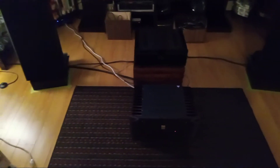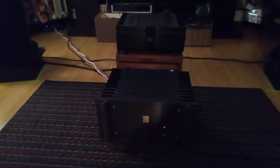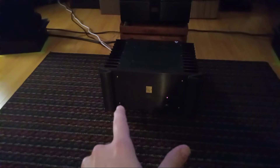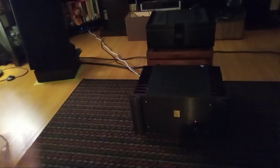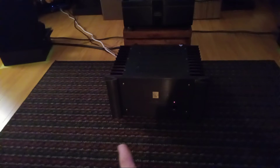Basically, it's ground noise. Specifically, I have a customer's Threshold T200 power amp in, and this one's doing it. I've had other components do it — power amplifiers as well as preamplifiers. Not everything does this. It seems to depend on how the internal ground arrangement is in the unit. In my apartment building, I have noisy ground problems, and even with all the filters I've thrown into my system, some stuff still manages to get through and is audible on the speakers.